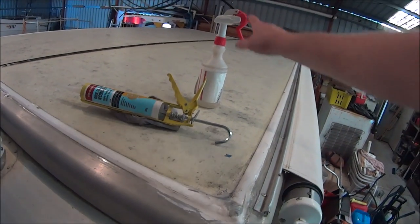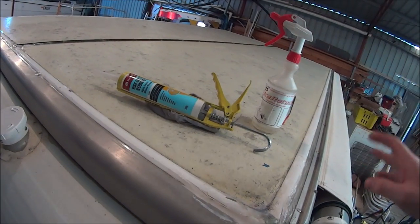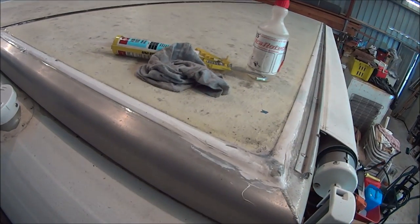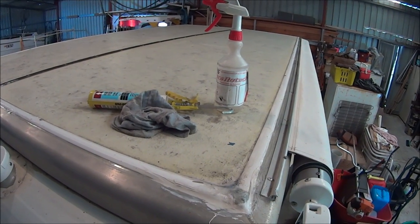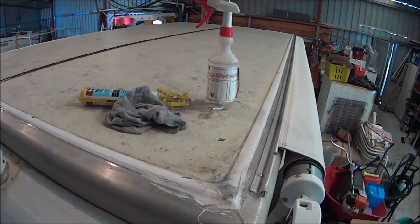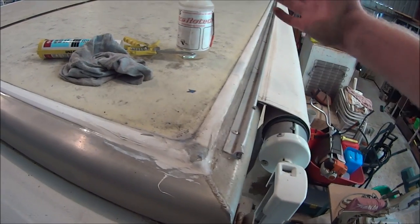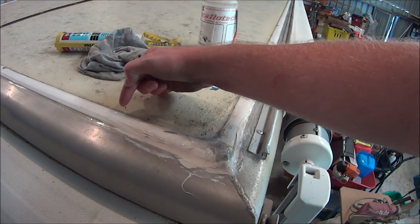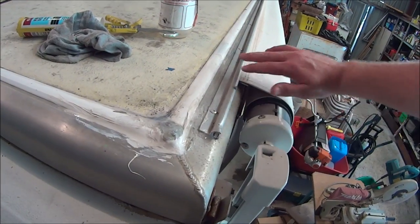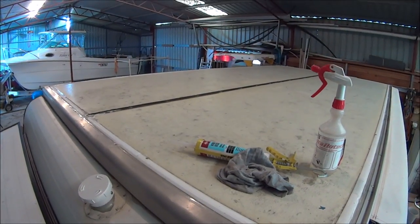Before I put anything on there, I sprayed mineral turpentine all over everywhere I was going to apply silicone, then gave it a quick rub down with a rag. I didn't want to dig out all the old silicone because of the year this was built — it's highly likely there's asbestos in it. So I'm going over it rather than removing it, which means less chance of airborne asbestos. I put the silicone anywhere water can pool — everywhere there's joins. I've done it on both sides of the plastic bead, both sides of the aluminium trim, and both sides of the alitrim that joins the two sheets on top. Basically anywhere there's a break in material. Two tubes of that takes about an hour, and it's certainly going to slow down if not stop any water ingress.